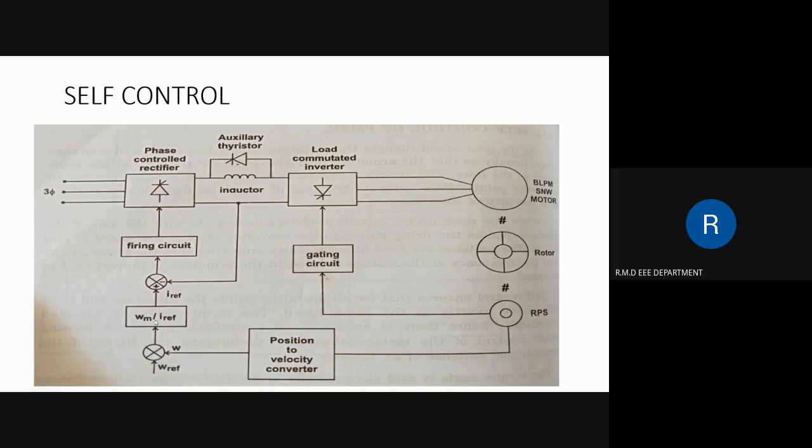At high power levels, the current fed by the DC link converter is employed. During commutation at low speed, the DC link current is pulsed by phase shifting the gate signal of the supply side converter from rectification to inversion and back again to rectification. When the current is zero, the motor side converter is switched on to a new conduction period and the supply side converter is then turned on.